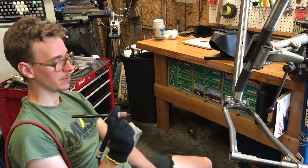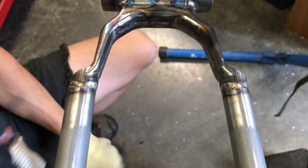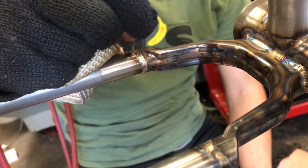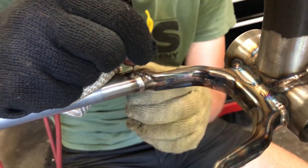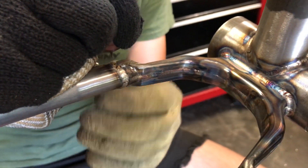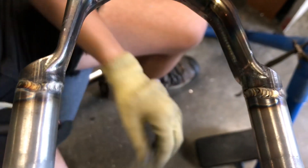It is a very hot day in the shop, but I finished these bosses here, and these are hard to weld — hard for me to weld. I'm not used to welding them. There's a thickness differential. The hardest part is probably that it's a smaller diameter, so with every pulse of the weld you've got to really change your angle a lot. For me, and probably for a lot of amateur welders, it's a lot easier to just kind of keep your torch angle the same and keep moving. So rapidly your torch angle is wrong, and your electrode distance gets a little bit harder to keep consistent. When you get a little bit further away and your torch angle is wrong, it kind of starts shooting these big flares — it heats up the gases around it. This should be structurally sound, but it's just not my best work. You just have to practice this sort of thing if you wanted to get better at it.